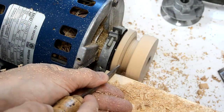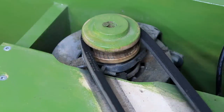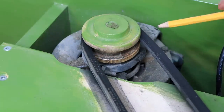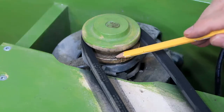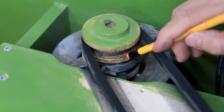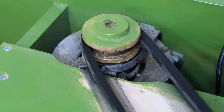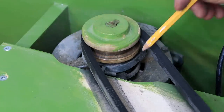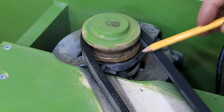I made the motor pulley out of wood. Part of the motivation was to cut $10 off the bill of materials, which basically pays for the plans. But the wooden pulley is not entirely optimal — you can see there are some cracks in it here and here and here. I think the reason it's got cracks is because it dried out too much from heat, because when I use this sander for an extended period of time that gets fairly hot.